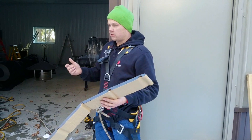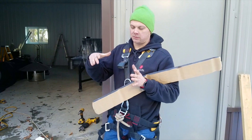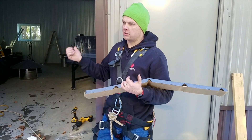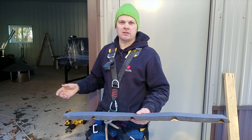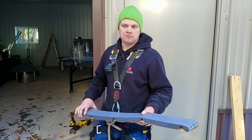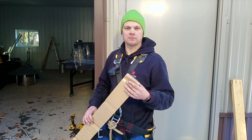I'm going up with a 5/16ths nut driver because the metal disc I cut is screwed to a purlin — I have to cut that purlin out of the way. I'll use the 5/16ths to remove the knockout, and I have a Sawzall to cut that purlin out of my way. The contractor can amend that however he sees fit. The fact is I couldn't get a 20-inch pipe between those purlins. I'll use a 1/4-inch nut driver to screw the roof jack down. The hole is cut and now we're going to install the roof jack.